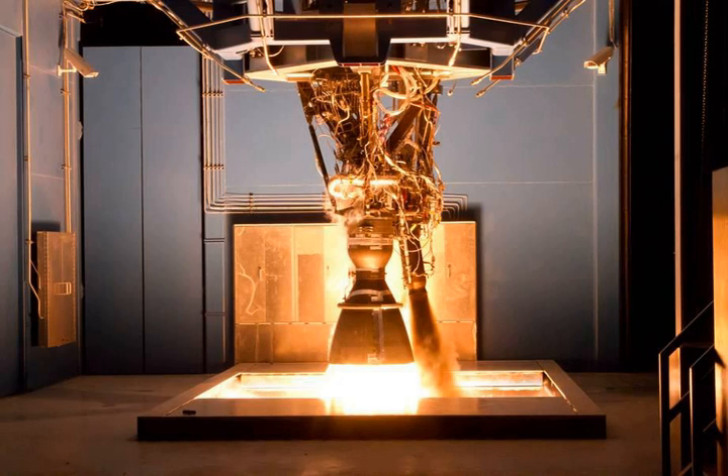The vehicle launched first on Flight 20 with 11 ORBCOMM G2 satellites. In May 2016, SpaceX announced plans to further upgrade the MERLIN 1D by increasing vacuum thrust to 914 kN and sea-level thrust to 845 kN. According to SpaceX, the additional thrust will increase Falcon 9 LEO payload capability to about 22 metric tons on a fully expendable mission. In May 2018, just before the Bangabandhu-1 launch, Elon Musk announced that the 190,000 lbf goal had been achieved. The MERLIN 1D is close to the sea-level thrust of the retired Rocketdyne H-1 and RS-27 engines used on Saturn I, Saturn IB, and Delta II.